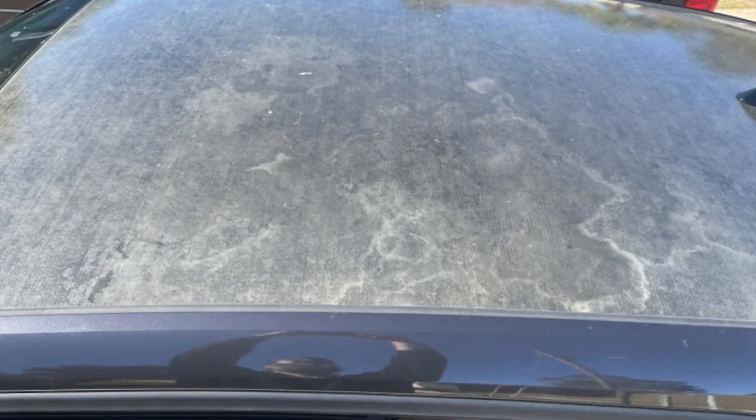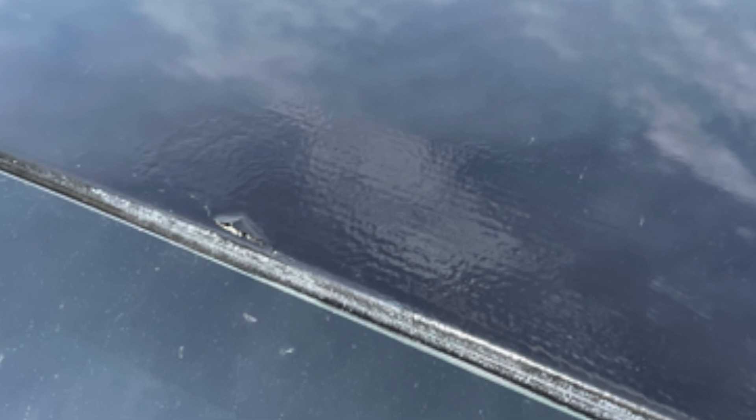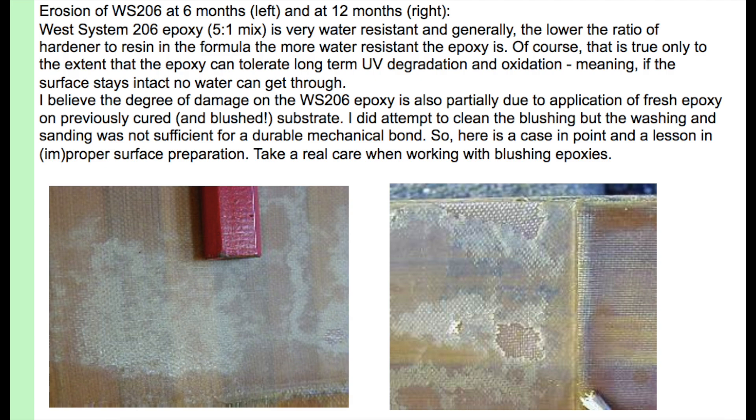I got some pictures of roofs that people have posted showing their carbon fiber, and you can see there's some delamination of either the clear coat or the epoxy itself. Some pictures show repair work was done, and there are edge effects as well. It's not uncommon — even other vehicles show discoloration and matrix breakdown. One review noted delamination from the edges and from a scratch in the center of the panels. Even fiberglass epoxy resins from a boat forum have similar delamination problems, especially with cracking and water ingress. So it's not unique to carbon fiber — any material embedded in an epoxy matrix has a similar problem.